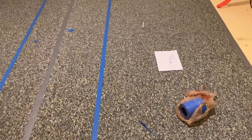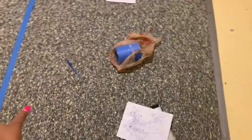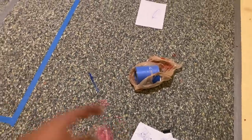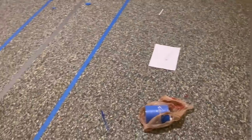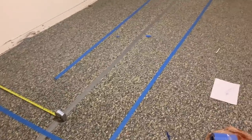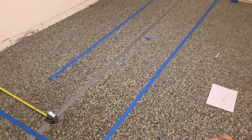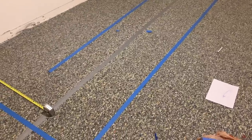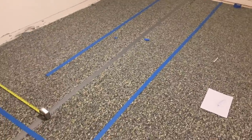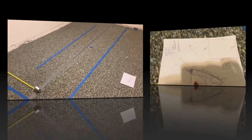If this is the edge of the riser, then the other row needs at least six inches from the edge of this to fully recline. Those chairs go on the regular floor. But I think this is a good blueprint of the riser. Now we just have to build it — we'll be using two by eights or two by tens, along with plywood on top and then insulation. We'll see, but I think this is a good blueprint.